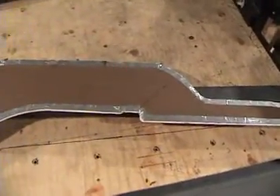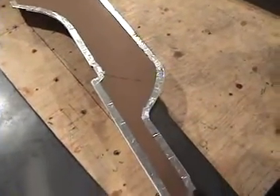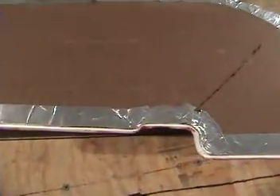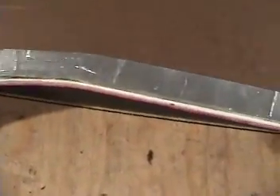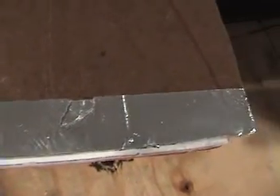What I've done since last time is I've cut out this board here. It's made of 3/16 inch masonite, and I cut it out to match a quarter inch foam piece that was mocking up my rear plate that goes through the rear of the car. I've allowed an eighth of an inch on the wooden plate — that's for the distance of my plasma torch tip, which is about an eighth of an inch off the edge when you drag it along the edge of this template.